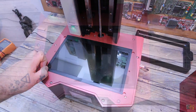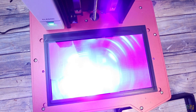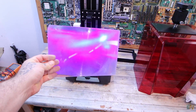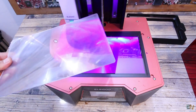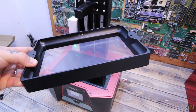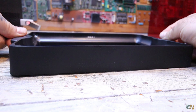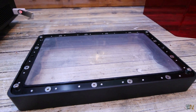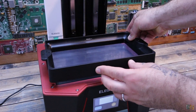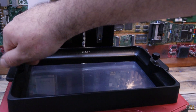They now have a new light system with a fresnel lens. Basically they have a powerful UV light just below, and to distribute the light evenly they use a fresnel lens like this one here, to make sure that the light will reach the entire area of the display evenly. The vat is made out of metal and what I like is that it has the screws below, so when you put it on your table it will make sure that the FEP film won't touch the table. And when you place it on the printer, it uses those same screws and these holes to center itself on the screen. Then all we have to do is add the screws and tighten them.